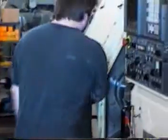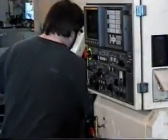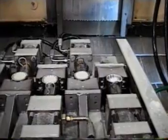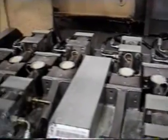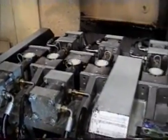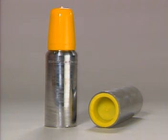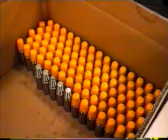The Type 2 taper system is machined and a rolled line is applied, which is a swage mark for the operator when attaching the couplers to the rebar at the fabricating plant, as you will later see. The couplers also have the size and lot number rolled on. Also, the coupler's threads are protected by color-coded caps, which is also helpful to the operator to assure the correct swaging dies are being used. The couplers are then shipped to the fabricator, where they will be swaged onto the rebar.